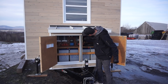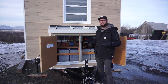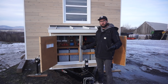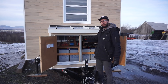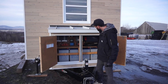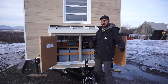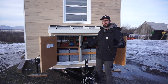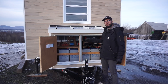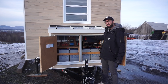If anything happens, you first check if a fuse is burned. That's where you connect your circuits. Right now there are two more circuits available, so if the customer wants to add an exterior light or anything else working on 12 volts, they still can — there are still open spots in the fuse box. After this, all the circuits go inside: the lights, the pump, everything that works on 12 volts.